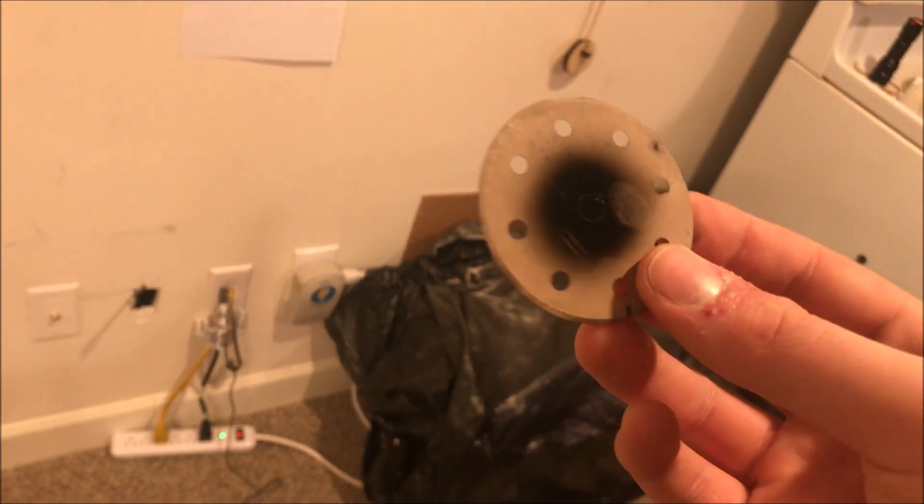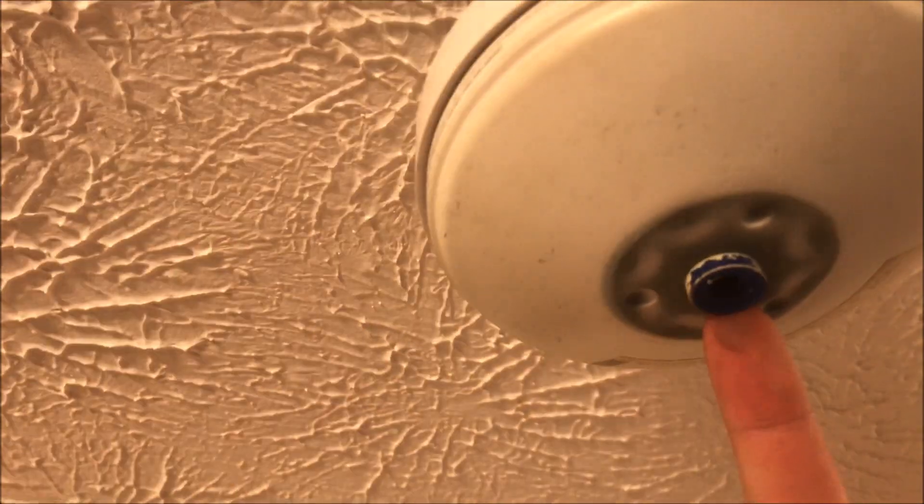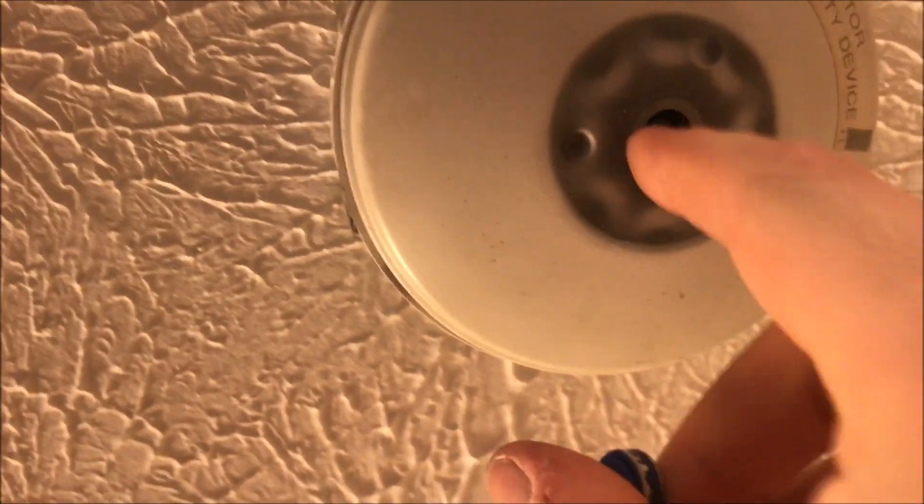So here's the disc. I think the smoking was actually the paint burning off. But this little ring — look at that — that little ring was soldered on to that blue gasket. You can actually see there's still a little bit of the solder. Inside you can kind of see the button in there. This all went on like this, and when the heat melted it, it fell off, and that allowed the button to shoot back. The button shot back and closed the detector. So just throw away that detector now. Thank you very much for watching, and as always, have a wonderful day.